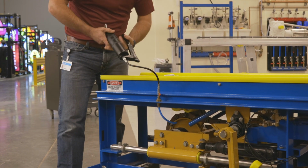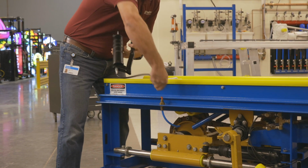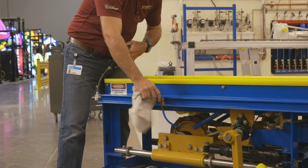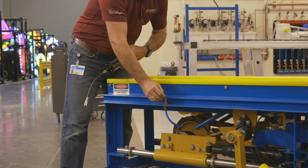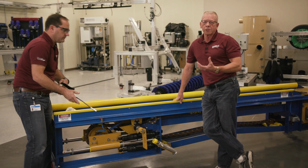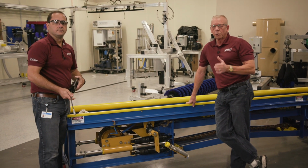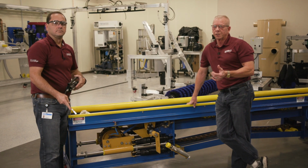Old school thinking in the car wash business was always we'd pump grease until we saw grease come out of the grease fitting. What we're doing if grease comes out of the fitting, though, is we're breaking the seal of the bearing. And we don't want to do that because water can intrude and dirt can get inside, and that bearing won't last nearly as long. So 1 or 2 pumps until you feel resistance is the key.